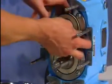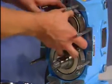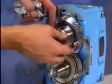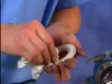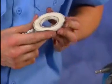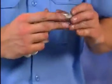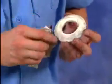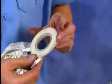Remove the seal seats and the shaft O-rings. Use even pressure on both sides so that you won't crack the seats. The shaft O-ring should be replaced and the seats cleaned and inspected thoroughly. Do not reuse the seal seats if they're cracked, chipped, scratched, or grooved. In a typical repair, such as this one, when the faces are not damaged, they are not replaced. Depending on which seal arrangement your pump has, some color transfer between seal faces is normal.